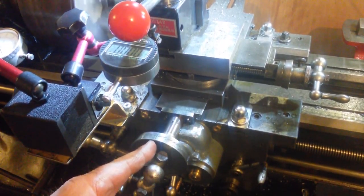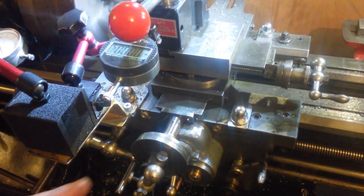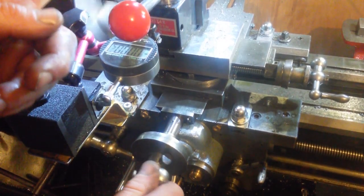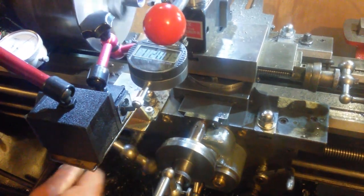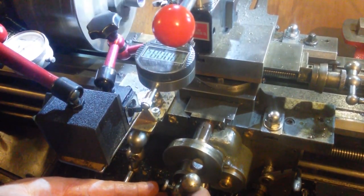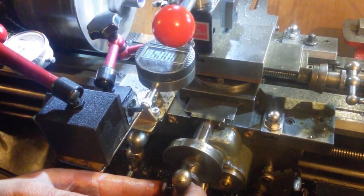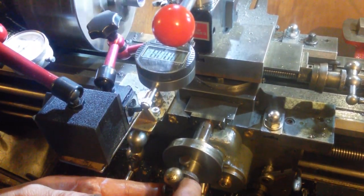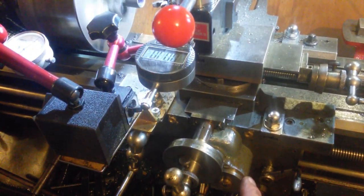And this is the cross slide adjustment. So I've gone all the way into my gap at the end. I'm now going to wind the cross slide that way a little bit, come out of the cut, bring it back to zero, put on 5 thou, maybe 10 thou. It's first cut, 10 thou, come on 10 thou. So now I'm ready to go, I'm going to look for the one to come round.